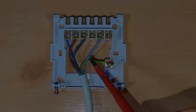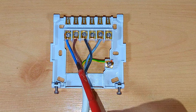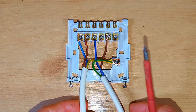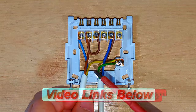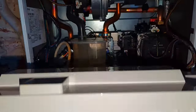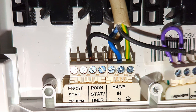One thing that is imperative: we must not muddle up high voltages with low voltages — that will definitely blow your circuit board. My preferred method of wiring is to use a five-core flex — we have a live, neutral, and earth, and then two switch wires on terminals one and three. Here's the same method again but using two bits of three-core flex. When I don't want to use two switch wires, I wire the receiver unit with a live, neutral, and earth, then a link wire from live onto terminal one supplying power to the switch, and then a switch wire coming out on terminal three. This Ideal combination boiler has been wired with a live, neutral, and earth and a link wire, so there's only one wire coming back in.